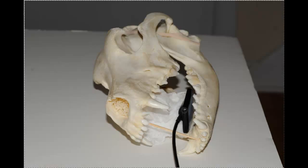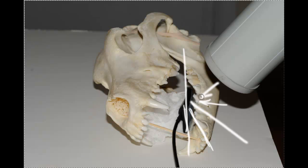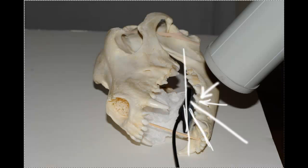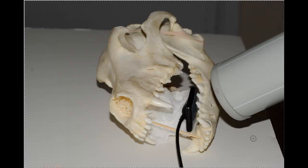As we move the sensor forward, we start to get a divergence between the angle of the sensor and the angle of the teeth. So now we have the sensor approximately at this angle, whereas the teeth are about like that, so our angle halfway between would be roughly like that. We'll bring the cone in — first pointing it straight at the sensor, then straight down at the teeth. Looking directly at the sensor, directly at the teeth, and when we split the difference, we're pretty much parallel to that bisect.